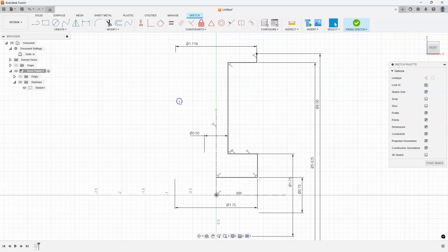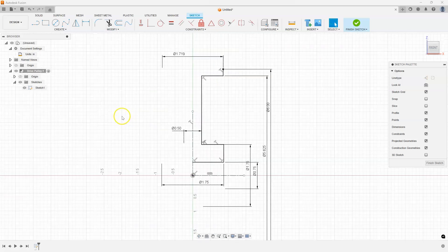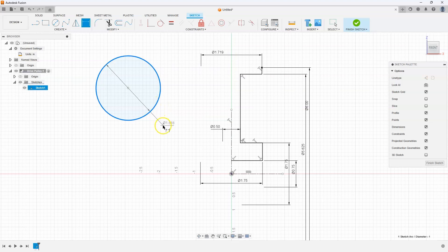Now looking at the sketch, it's all black, but I still need to add the curve that goes across the top. Bringing the drawing back, you can see it's a crowned surface with a radius of 6. To do that, I'm going to create a circle. It's asking for a diameter dimension, so I'll just draw a circle — I don't care about the size right now. When I create a dimension on this circle, I can right-mouse-click and change it from diameter to radius, and set that to 6. The circle gets really big.